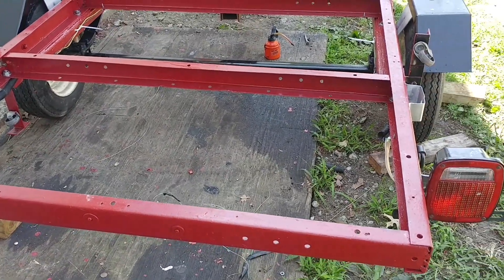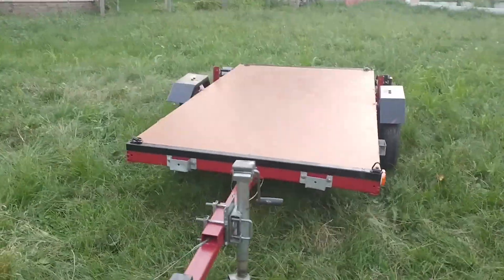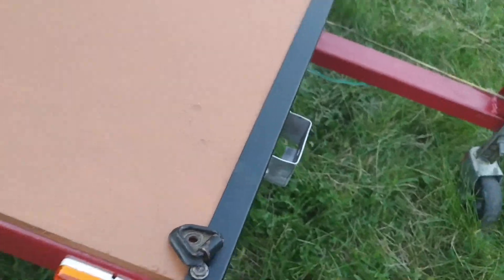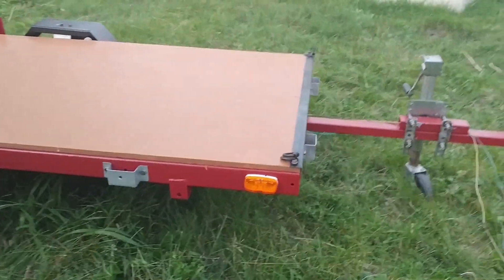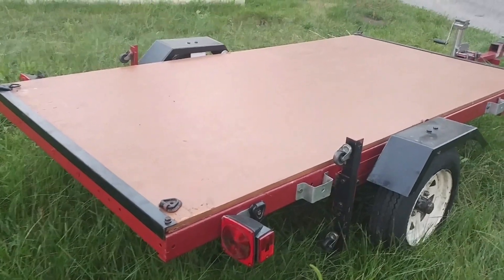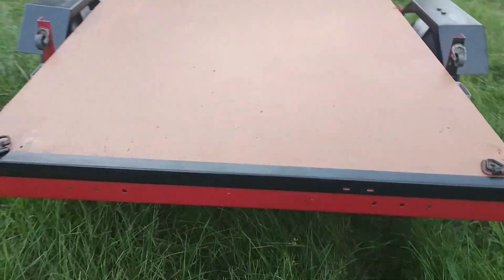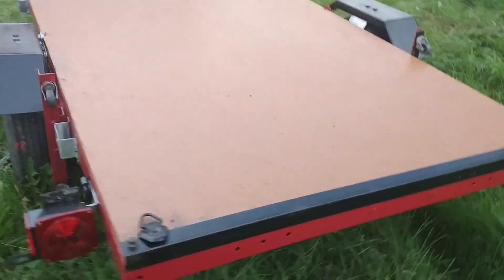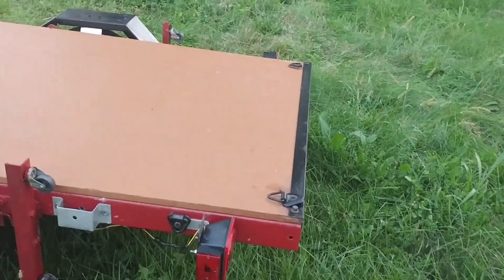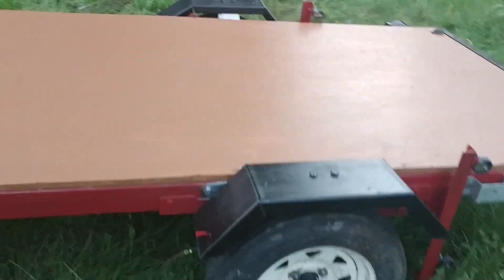She's 99% done. Red oak is installed with a nice fancy paint that was on clearance. These hooks will be installed. Another tip: if one light is working but you have power to it, check your ground — you need a real good ground to pull power. Never use bed frame; it's impossible to drill through. Corners are reinforced — the bed frame angle iron will keep the board from getting all screwed up. You've got tons of hooks to tie down; you can never have enough tie-down hooks.